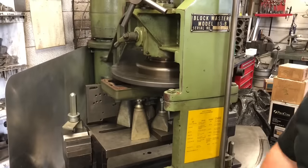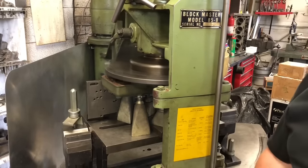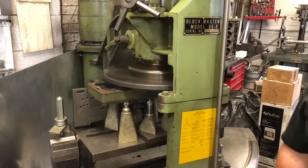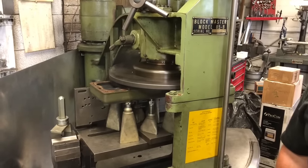You've got to watch — the reason I got those other stands in there is you don't want to bow this. If you mill it while it's bowed and then it relaxes, now it's freshly milled and bowed — screwed up.